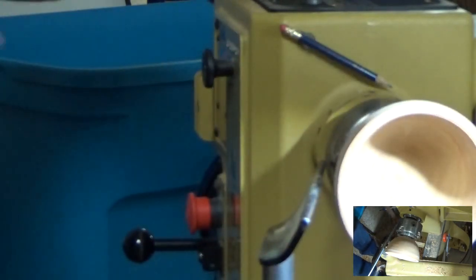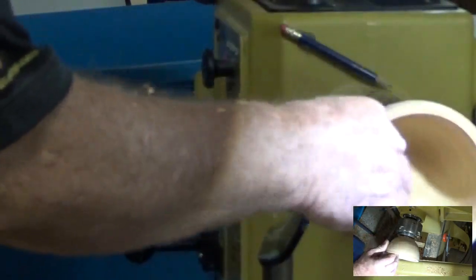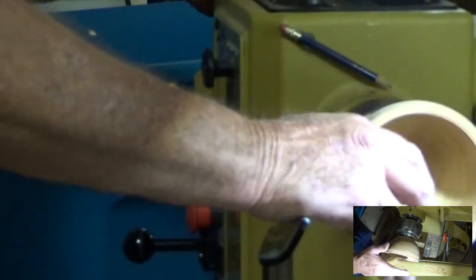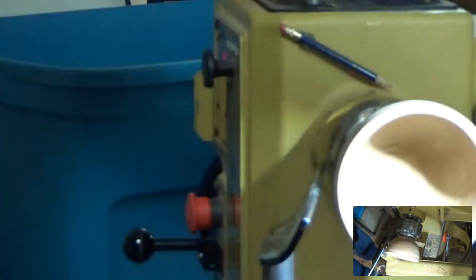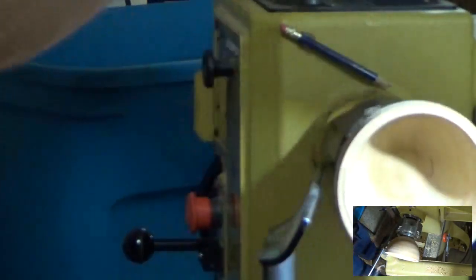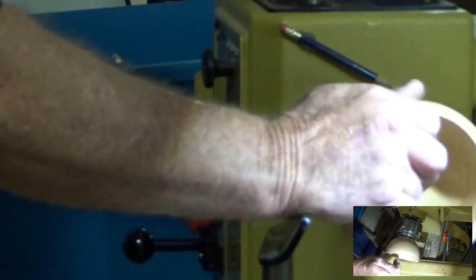Do you sand your shellac? Yeah, I'll usually sand, heavy, but lightly. And then I sand between each coat. Depending on my wood, if I have a real porous wood, I'll sand with some heavy sandpaper, maybe 220 between coats until I get those pores filled up, and then I'll go up to 320, 400, or 600, or whatever. And the last coat I put on, usually like 800 grit, and put my coat on, and I use steel wool a lot to clean that off.